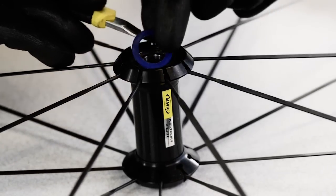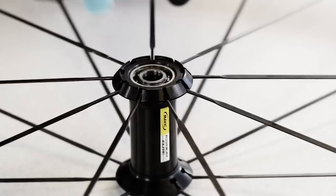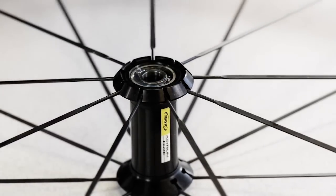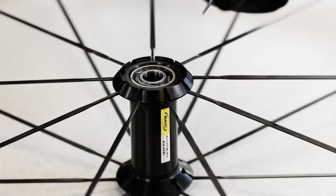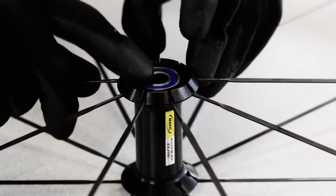You can use a brush dipped in degreaser to remove any contamination. Make sure that all the degreaser has vaporized before you add grease. Now add grease to the bearing. To obtain the lowest friction combined with a good lifetime, we recommend a fill grade of 50 to 80%. After that, mount the seal again and press it into place.